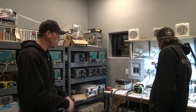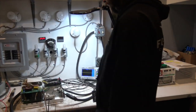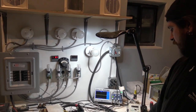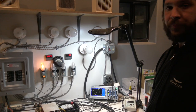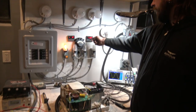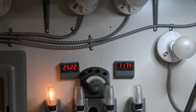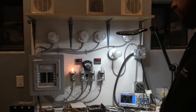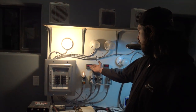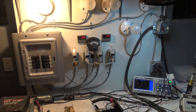So let's do some inverting — let me bring the camera over here. You can see here's the sine wave on the scope — right now there's no sine wave because the inverter is in the off position. And there she is, here's the sine wave. We have our battery bank below, 118 volts coming out of it, pulling the battery bank at 25 volts right now and discharging at 1.1. What's the hertz on that? 60 hertz. Now we have 300-watt power, which brings our batteries down a little bit but our voltage stays the same. At 300 watts, we're pulling 12, almost 13 amps out of the batteries.